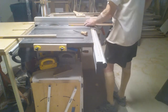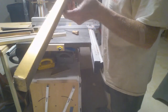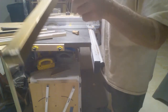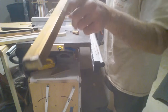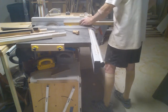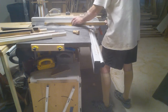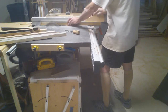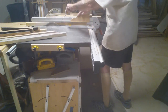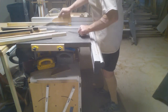Now what you see here is this gold on the board — that's either epoxy paint or powder coating. This is terrible on a sander; you'll change your belts so quick. I've learned that from trying to sand it off. So what I'm going to do is take just a tiny sliver off, just enough to get the gold off, because I want to keep as much of the wood as I can. I'm just going to rip it down, taking just the edge of the paint off. The saw blade is better to do it.